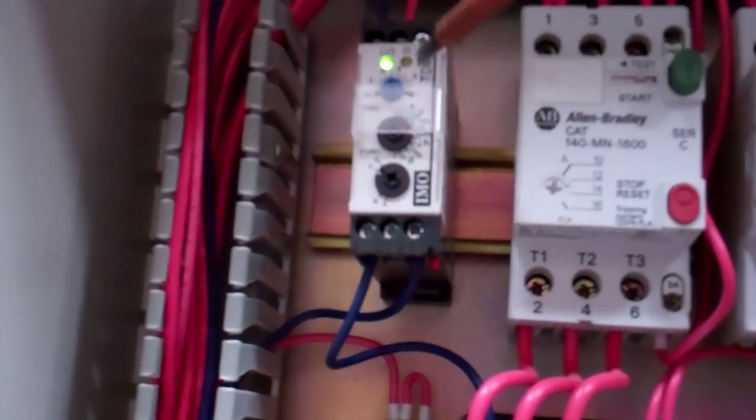So even if it went off and came straight back on again, this will hold it off for four minutes. Once it's done its four minute count, it then allows it to start if it wants to. So as long as it's been off for four minutes it'll start straight away. But if it's been off for more than four minutes and the thing is cooling, it'll fire up straight away. If it goes off and wants to come back on again it'll have to wait - so it's sort of like an anti-cycle timer, rather than just wiring it up to delay at start. It's a bit more complicated but I think it will cause less trouble.